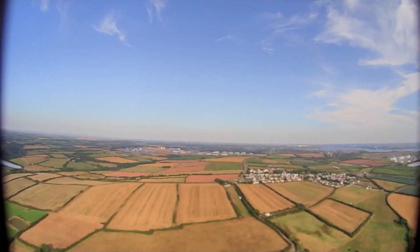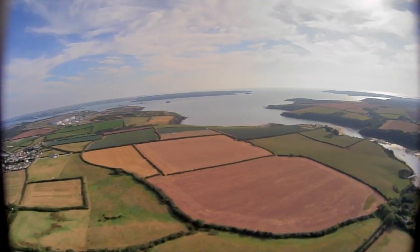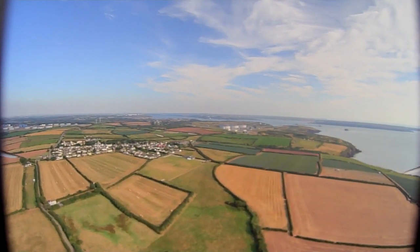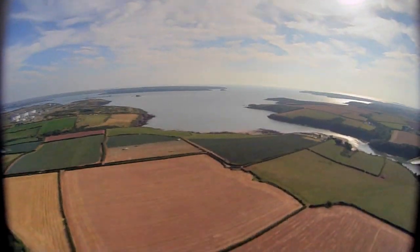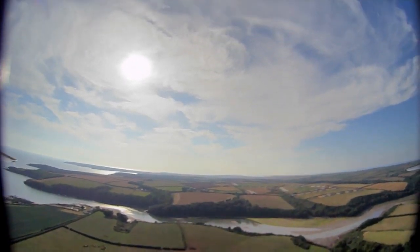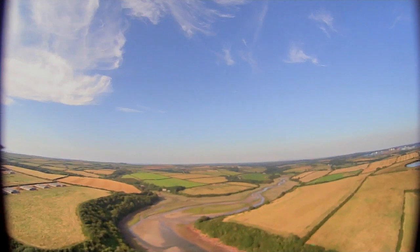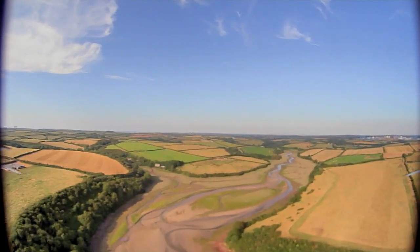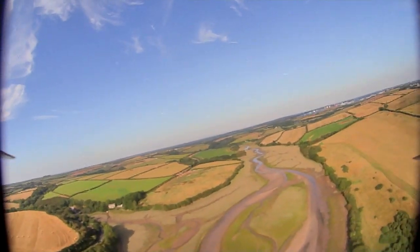Regarding the new camera — I do like it. The colours are good, the auto white balance behaviour is good, and it gives a really nice image overall. There is quite a bit of fisheye on the lens, but that's expected. Moving to the Scout HD goggles and the overall feel of the system — the image quality on the screens is really, really good. The DVR footage does not do it justice. In flight the goggles have a decent field of view — I'd have preferred more immersive, but you get used to it. There is some interesting behaviour I found in flight: the patch antennas are extremely directive, and they seem to be the primary antennas used even when I've got Omnis installed.